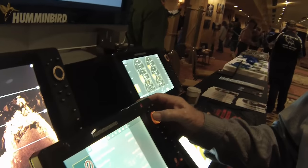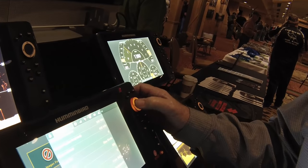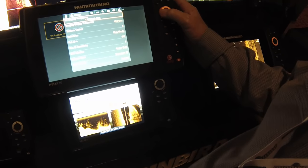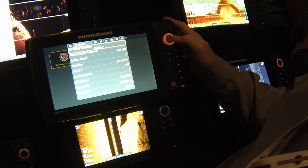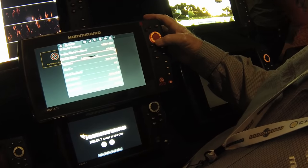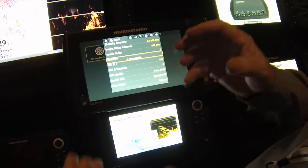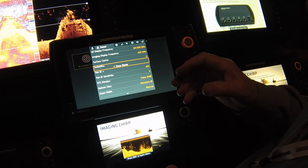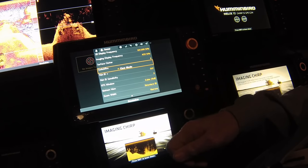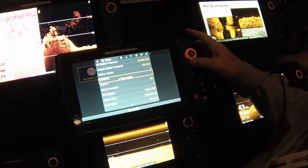So I went to sonar — I don't ever mess with alarms, I leave alarms alone. I'm going to go in here and just kick your button twice, come over here to sonar. On sonar, 200 is a narrow beam and 83 is a wide beam — 83 shows you everything on the bottom. I run a lot of 200/83, so I've got a real narrow beam going down in the cracks and crevices of the rocks, and my 83 is wide. With SwitchFire, clear mode takes a lot of interference out, while max mode is made for deeper water. Around 25 foot or less, run clear mode. Deeper, you could put it in max mode if you're drop shotting or jigging — it'll show your jig going up. We're usually dragging baits behind for catfish in 35-40 foot of water in the high river, so clear mode will be fine.